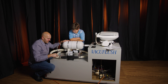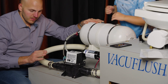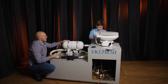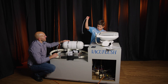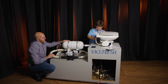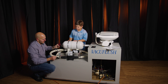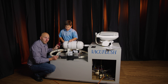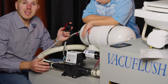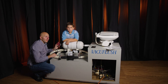We stick our vacuum tester gauge right here — grab a heat gun, warm this hose up, pull it off the pump, and stick the tester gauge in. We'll try the digital gauge; I love the digital gauge, that's what I use every day and I recommend it for all professionals. We take our vacuum tester gauge, stick it inside the pump port, let it run, and wait approximately 30 to 90 seconds before we jot down what point the gauge shuts off at. Then we wait the allotted time shown in the instructions.